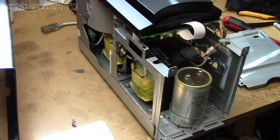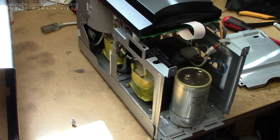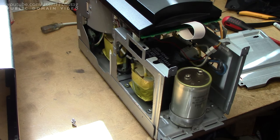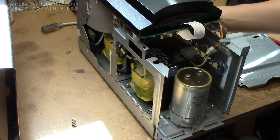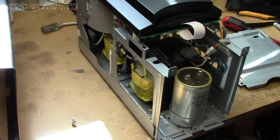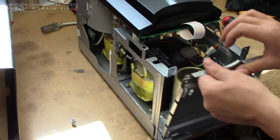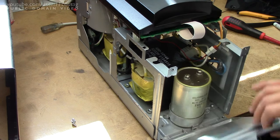Another modification I'm going to do to this unit prior to reassembling it is to add this giant capacitor inside, because the modification to make it run on 12 volts means the original capacitance installed on the board — about 6,800 microfarads — isn't really enough to give the juice to build up the field in these dual transformers. The unit has a tendency to just reboot a couple of times before you actually manage to power it on, unless you have an external capacitor connected. In the past I've just had a capacitor connected to the Anderson connector on the back, but it's not a very tidy solution. This capacitor here just happens to be the perfect form factor to sit in there, so I'm going to add it, cut the screw holes, and wire it up.